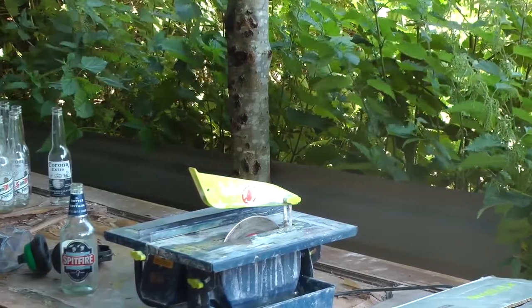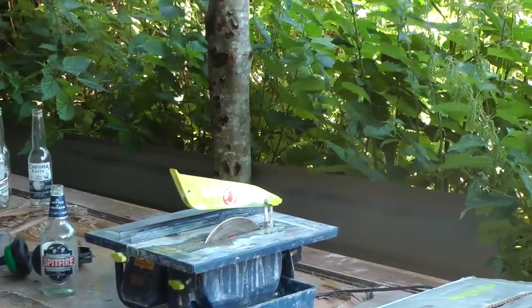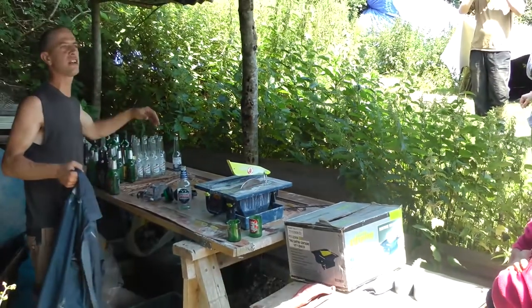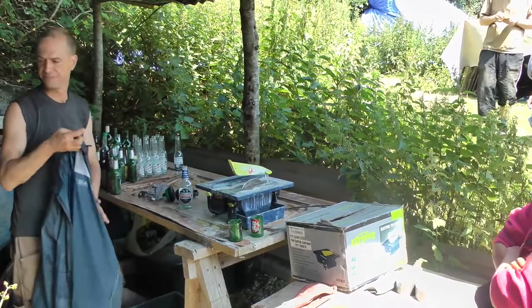The other thing is that I mentioned about the properties of glass. I'm cutting colored glass here, so it cuts through it a lot easier. If I was cutting clear glass, I would just go a little bit slower, just because it's harder, and you just want to give the blade plenty of time to do its thing. Now,